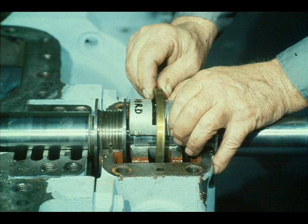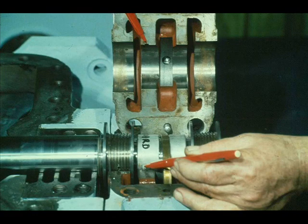It's important that you lower the bearing half onto the shaft very carefully. Make sure the top half of the bearing is aligned with the bottom half. Repeat the procedure for the opposite bearing. Now the bearing caps are lowered into position on top of the bearing liners. Make sure that the locating lugs in the top halves of the liners fit in the corresponding notches in the caps.